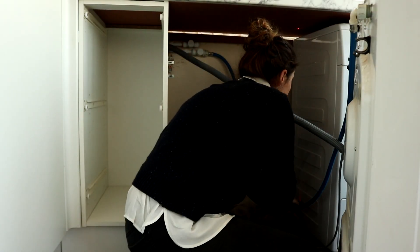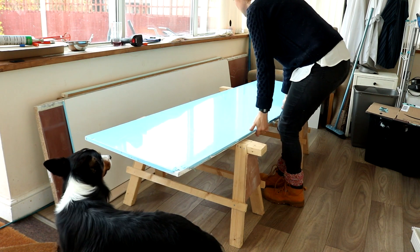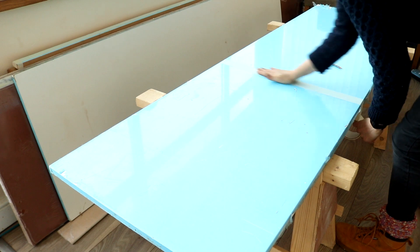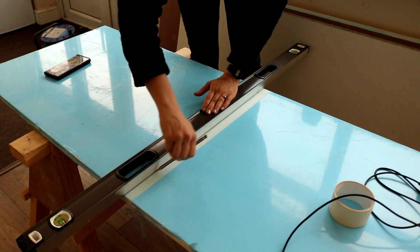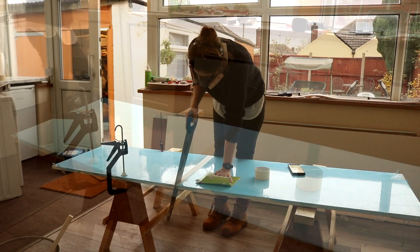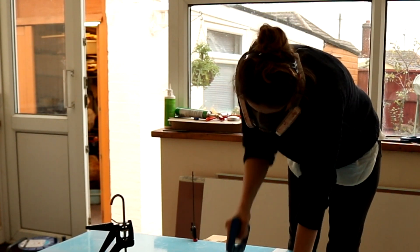There's a little bit where it's carpetless, and I actually had a load of spare end panels in my garage from when my parents helped fit our kitchen. I masking-taped it up so I could cut it down to size. Because it's MDF, I wanted the sealed edge to sit on the floor. I transferred the front and back measurements onto the panel, then matched those up using a straight edge. I clamped it on my sawhorse and used a hand saw to cut it down — wearing a mask with the door open, though it was too cold to go outside.